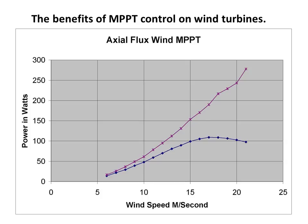This will result in a large gain in power — we've routinely seen 2 to 3 times the productivity for most turbines. The Classic uses a 16-point power curve that the user can adjust for their particular turbine. We also have preset power curves for many popular wind turbines pre-programmed in, and we'll continue to add these. In the future, there will also be a wind learn mode that will adapt a starting curve to your particular site, always tweaking to make sure it's being as productive as possible.